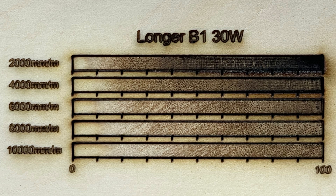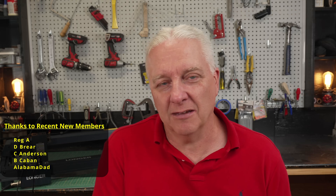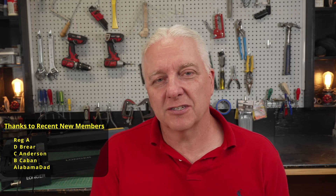Looking at the grayscale results: at the 2000 mm/min line the extreme right is very dark but also really charred. Going down to the other extremes, you can see the boundary between mostly white and mostly dark shifts more to the right — a better balance from a gradient perspective, with a lighter right-hand side. I'd recommend the 10,000 mm/min speed for photo engraving with grayscale; 8,000 looks good too. I wouldn't say 4,000 is acceptable unless you want really dark output or it's mostly a light image. That covers the grayscale engraving results.